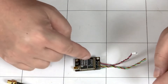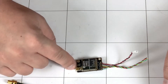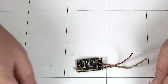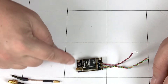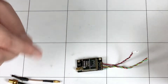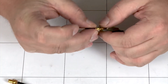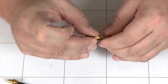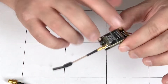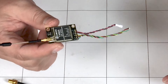Word of warning: never, never power up a video transmitter unless you have an antenna attached. The basic principle is that it's trying to transmit, and without an antenna to absorb that energy, it will get reflected back into itself and burn itself out. Never turn on anything that transmits without an antenna attached. If you want to run it with the dipole, you just hook it up, plug it in — nice satisfying click — and then you're on. Put this in your stack, bend the antenna up so it sticks out of the carbon fiber a little bit, and you're flying. Done.